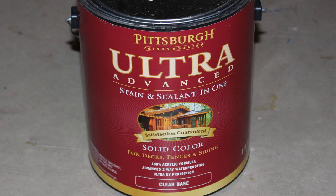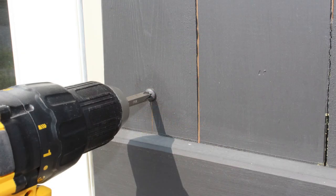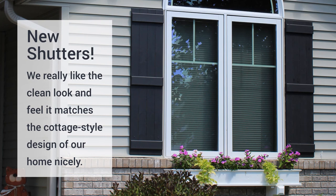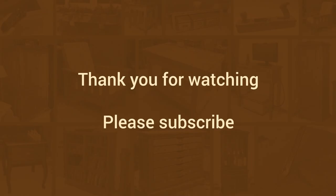We chose to paint them with a solid stain — this is a really nice product we get at our local home center. I chose the color ebony, which was a really deep black. We just used the old screws that were from the other shutters to mount them — drilled holes right through there and drilled right through the siding, and then you can see we painted over the screws so they would match. And when we were done, here are the new shutters. Like I said, we like how they match the cottage style design of our house and that the highlight really does catch the top of those. Thank you for watching.